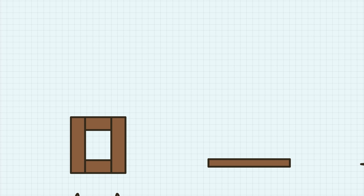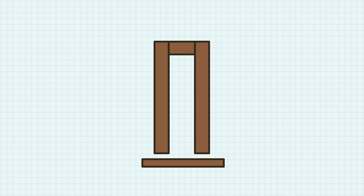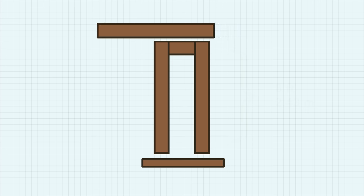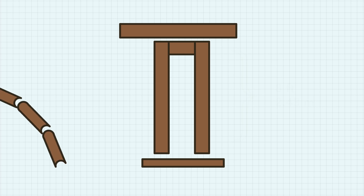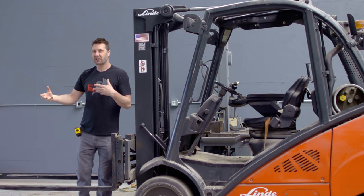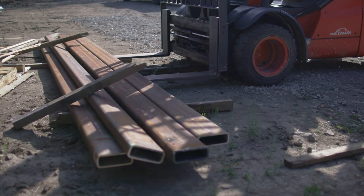So here's my design. First I need a base that's going to attach to the forklift. I need a special tall mast that will give me the clearance and reach I need — elevating about eight feet. The next design criteria is a mast that moves in and out, and maybe some sort of articulating piece on the end to help position my work. You can't really buy something like this, so we're going to build it with the materials I have around the shop.